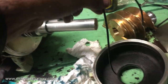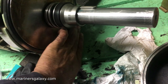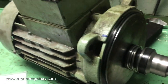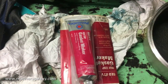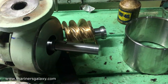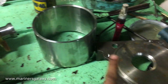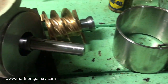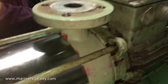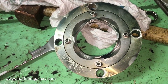The motor has been overhauled. Now let's start reassembling the pump. The first O-ring goes in; since the groove is not very deep, I'm using Permatex gasket maker so that the O-ring stays in place and doesn't come off easily. The casing is in now — we have to put the rotor, then the rotor casing, and then the end plate. The casing is assembled with Permatex all around, and there is an O-ring inside as well. Now we have to put the blade holder.